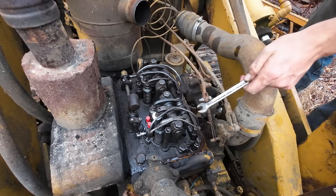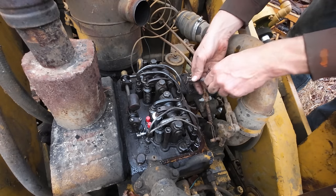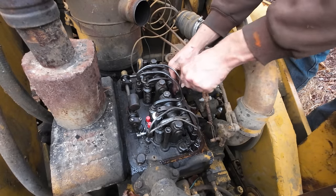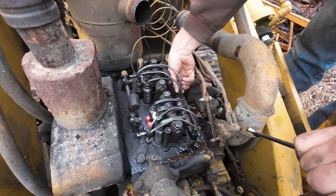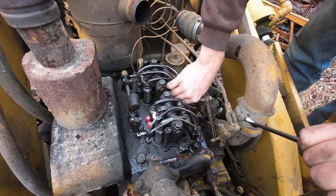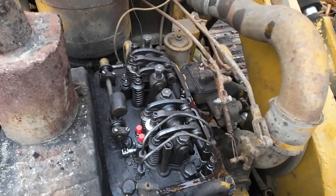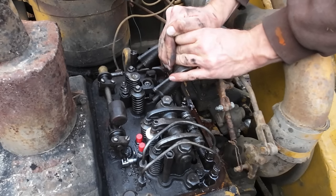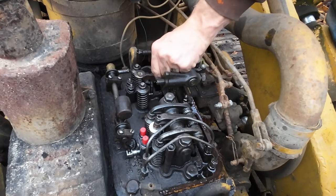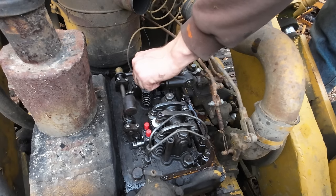All right, so I put these fuel lines back in place here just to keep dirt out of the fuel delivery galleries. I'm gonna switch out our other injector real quick, and then we're gonna have to set our valve lash, and then our injector timing, which I can show you how to do that. We kind of got some special tools to do that. And thanks to a generous subscriber, the only reason I even have them. I'm surprised at how easy these injectors actually come up out of here.